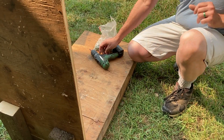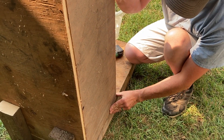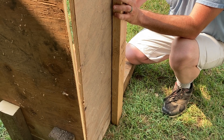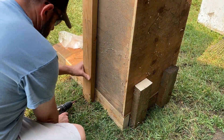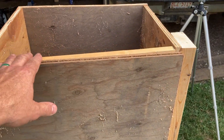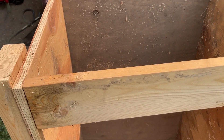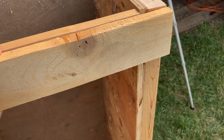Next I'm going to place the piece we cut right to size against the back, and the two by four should sit on the ground and run flush with the front. I'll put one or two screws in here to hold that and then secure it to the base. The issue I'm having is that without a cross piece — about 18 inches wide — everything's kind of twisted on top. So I put an 18-inch block in and cut a 22-inch piece to attach across, which will keep that top opening at the correct 14-by-18 dimension.